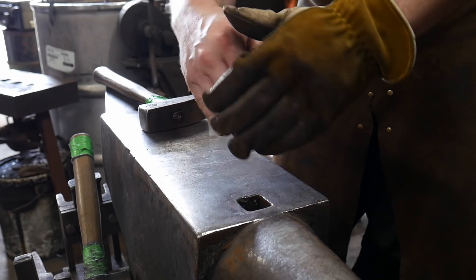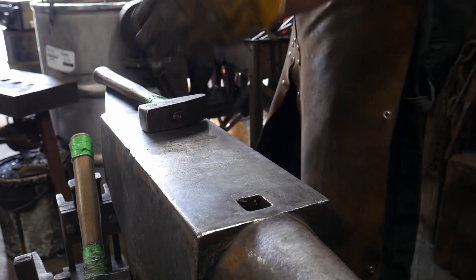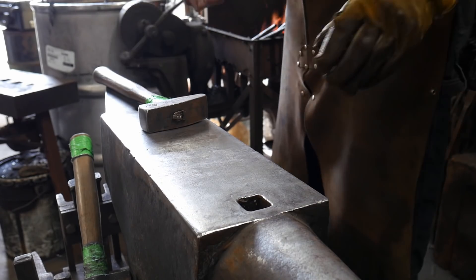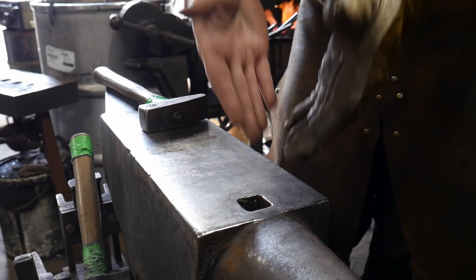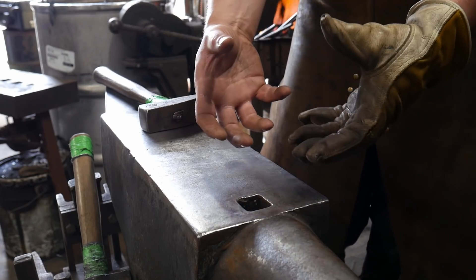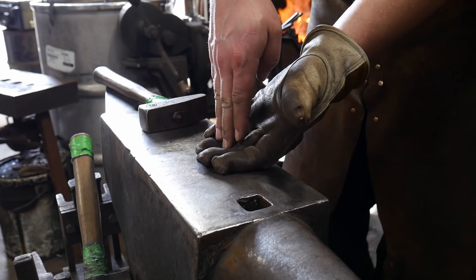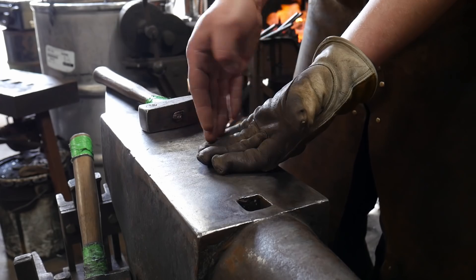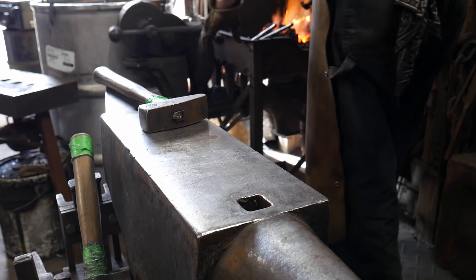Now you may not want to actually bend this. You don't want to really curve it or put a curve in the tool itself — you want to stray away from that. This way you have a little bit more mass because of the geometry of what this tool needs to do and the physics of it. You want this to be a pretty straight tool, just straight dug right into the piece, but then have a curvature on the inside. So most of that work will all be done with a grinder.